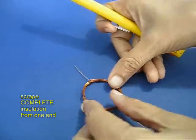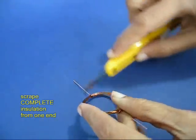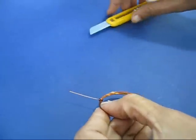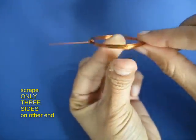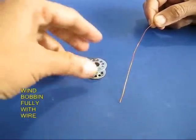This wire is insulated. Scrape the insulation completely from one end — you will see shining copper. On the other end, you just scrape the top, the left, and the right — only three sides. So one side would be totally copper, and the other side would be scraped on three sides: three sides copper, but one side would remain insulation.